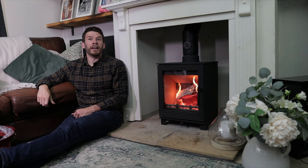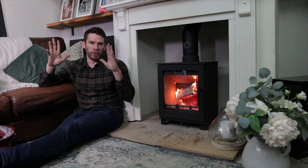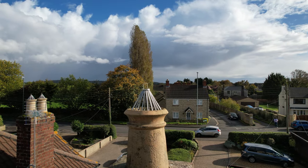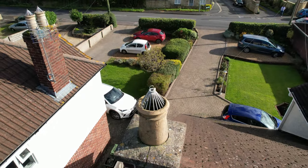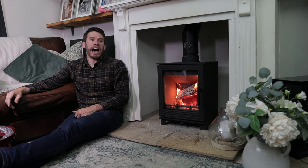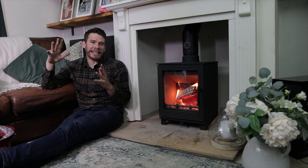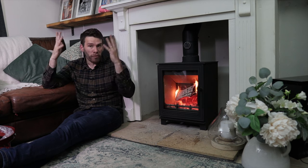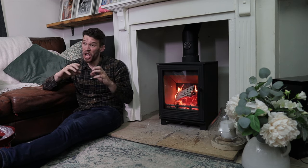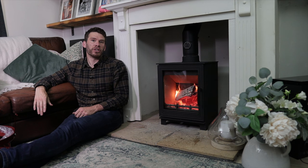The most simple cowling is a crow guard, which is like a witch's hat - just a few little spikes going up. The only idea behind that is to keep animals out of the chimney. In Britain, obviously our weather and the birds mean that isn't necessarily great - we probably need something more substantial. But the good thing about those cowls is they're completely unrestrictive to draw. Nothing, or something just to keep birds out, is always the best idea because it's unobstructed.